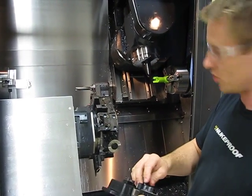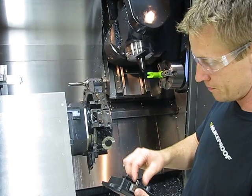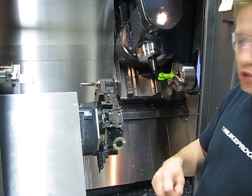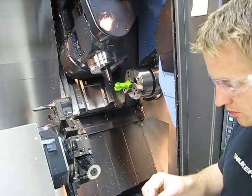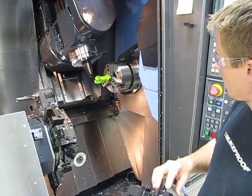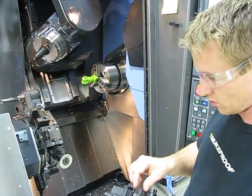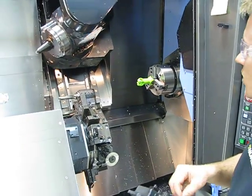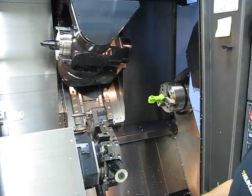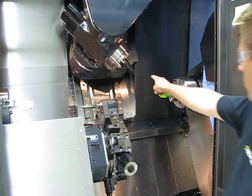It also has a Y axis, perpendicular to the Z axis direction. Then it's got another controlled rotary axis, and that also spins up to 5,000 RPM. And it has a rotating milling head. Let's move it out of the way to the safe spot here. This head can rotate up to 210 degrees either way. So you can do lathe work with this fixed tool on either spindle — it can access either.